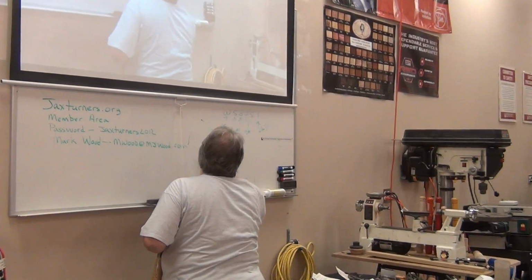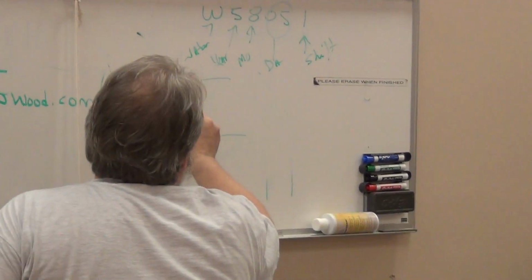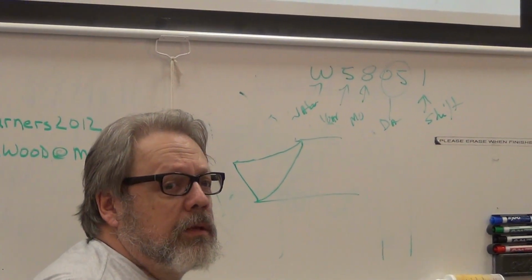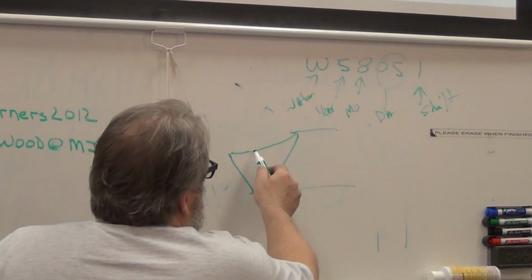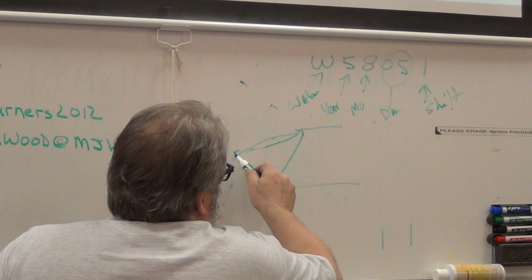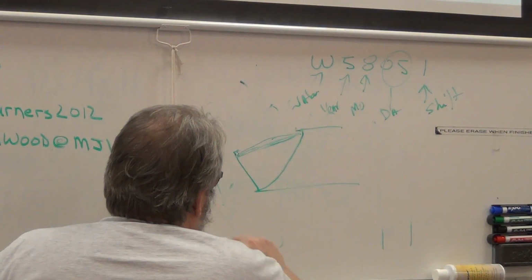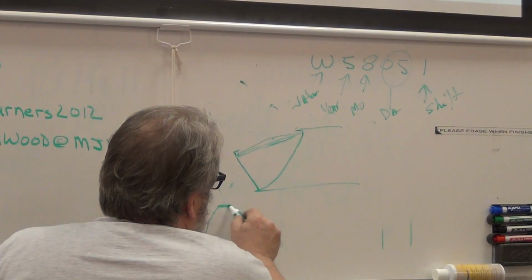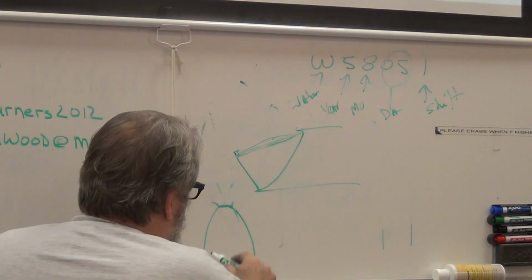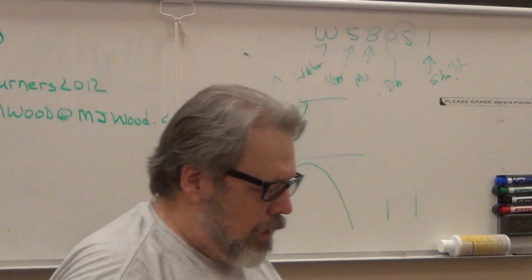All right, this little bit of a sweep. Coming straight, fine too. This is a bad thing. All right. Where you have your nose higher, you really have to bring this back down here, at least go to straight across. But if you grind too much here, it'll tend to look like this from the top. This'll almost be flat across there, and you'll have a sharp point here and a sharp point here. You want this to be a nice smooth parabola all the way.